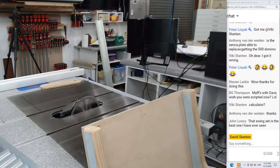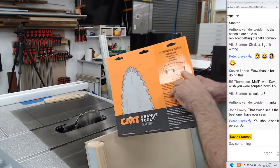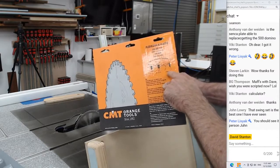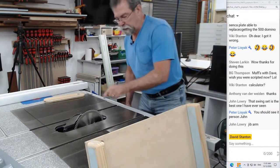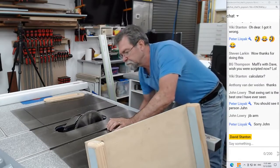Now I've put the Perspex cutting blade in. It's got a negative rake of 3 degrees, which is really good for plastics. It's not going to grab hold of it. That's up too high at the moment. I've just put the blade in. I've put the riving knife on. I'm going to lower this down